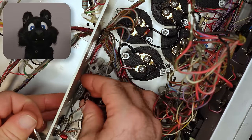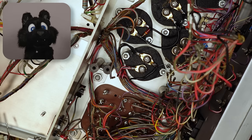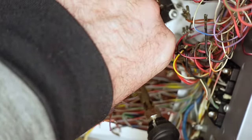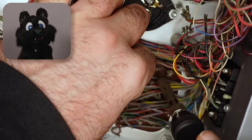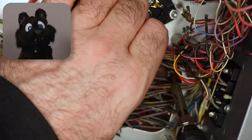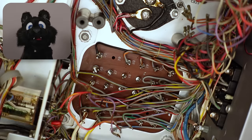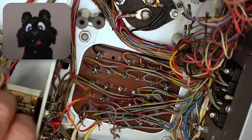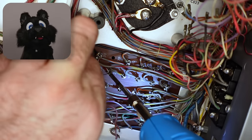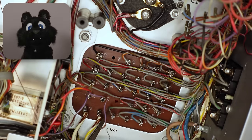There's another thermal cutoff switch here. This one turns off the mains input directly. The transformer with its bonkers number of taps is next. I kept the wiring loom as much in shape as I could, so I have at least a good idea of which wire might go where. The final validation is done with the before pictures and occasionally the schematic diagram for cross-validation.